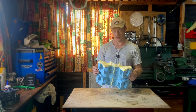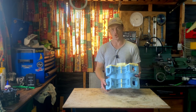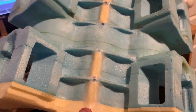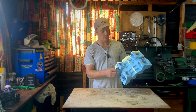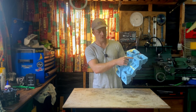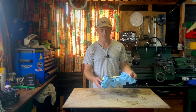All this needs now is I'm going to buy some unscented candles and use the wax to smooth out all of the joins. So anything you see on here it's going to show up in the finished casting. With the machined surfaces which will be machined flat I'm not so fussed, but when it comes down to these strengthening ribs they're going to look horrible, and also the joins down every piece of foam. So other than that, put the wax on.